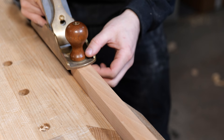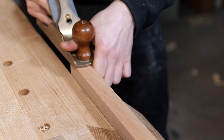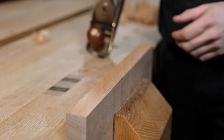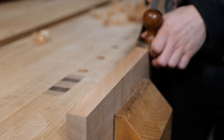What I'm doing here is using my finger as a fence. I get the plane in the position I want, hook my front finger over, and lock it in place with my thumb against the back of the front toe — that keeps the plane at a consistent offset from the edge. This will feel very odd at first, but the good thing is that it forces you to slow down. Be careful because there can be pinch points where you catch your finger between the plane and the vice, so make sure the material is elevated enough. Also watch this edge, as it can give you splinters or get sharp enough to cut you.